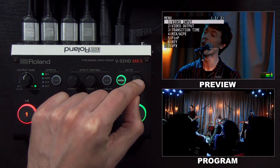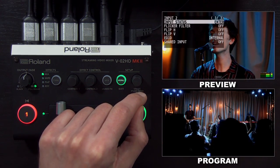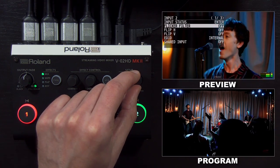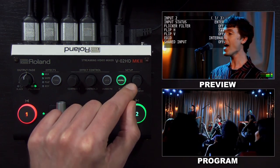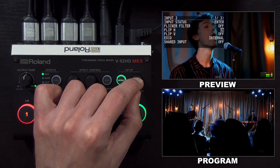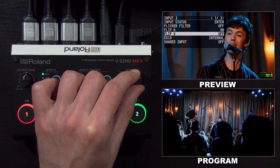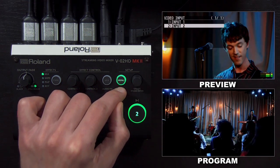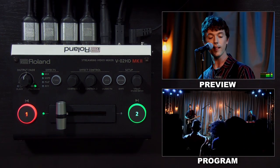If I want to go into the video input menu, I just push this in. If I want to adjust input 2, I select that and push enter again, and then I can adjust these settings. So if I wanted to flip the video horizontally, I push it — you see 'off' is highlighted — then I twist it and turn that flip on, and then I can push it again to go to a different setting. To exit the menu, just press the menu button and it will go up one level each time you press it until you complete the exit.